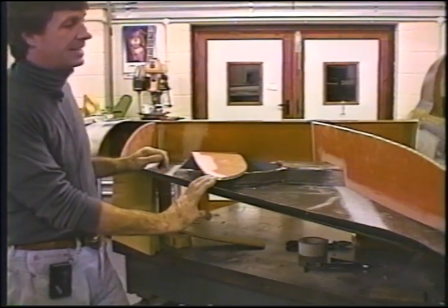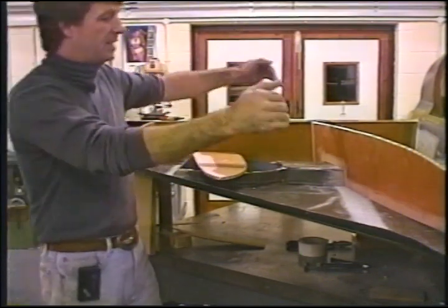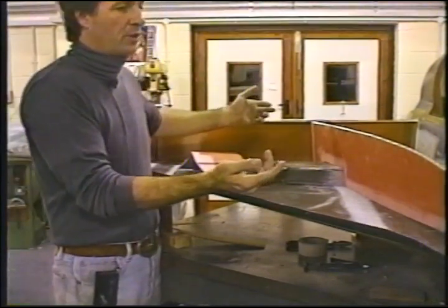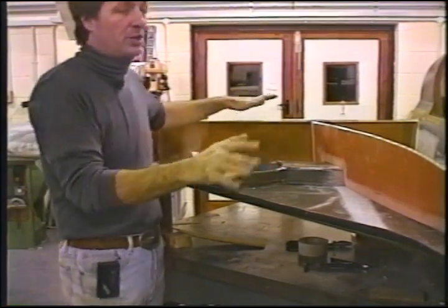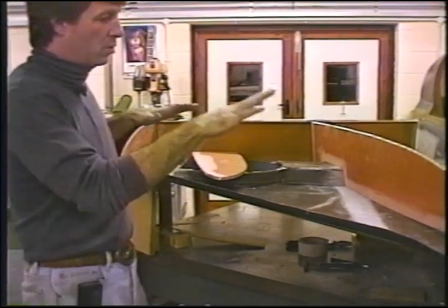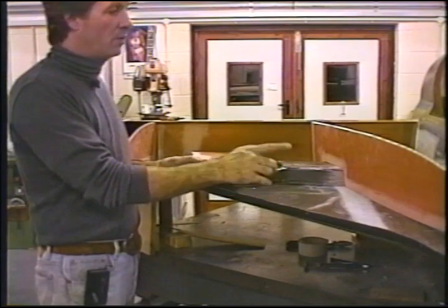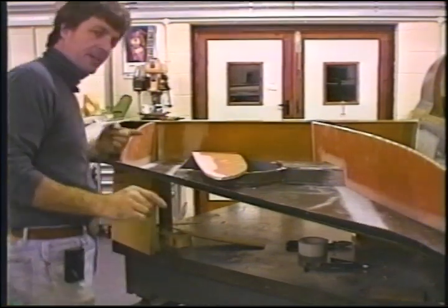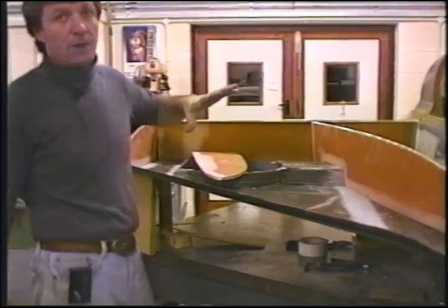Another consideration is that after you've got each rib done and in place, stick it in, run your drywall screws into the rib, and then put your top back on to make sure that you don't have any retrimming to do. Retrimming can be a real problem as you're trying to work the surfaces down. You invariably end up removing too much material. So do it one rib at a time while the wing is off so you can see in from the end. Make sure that it fits without any incursions. An eighth of an inch gap is preferable to no gap.